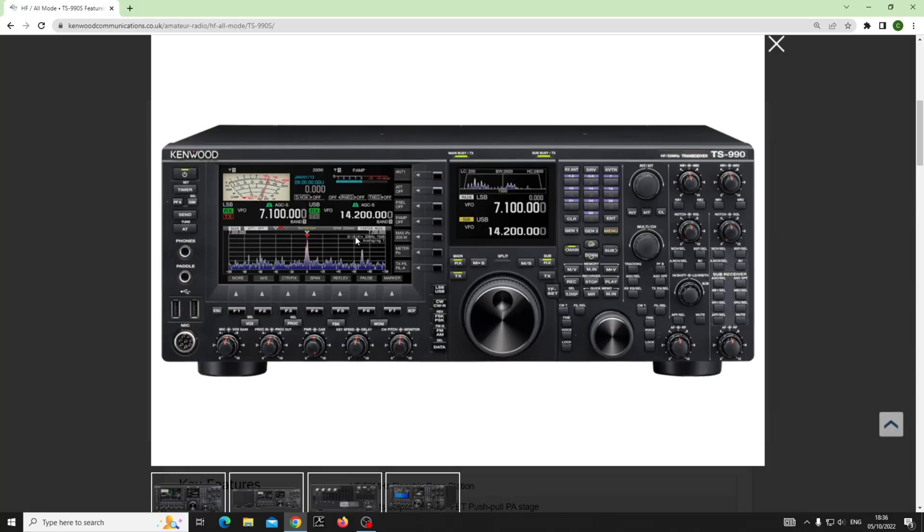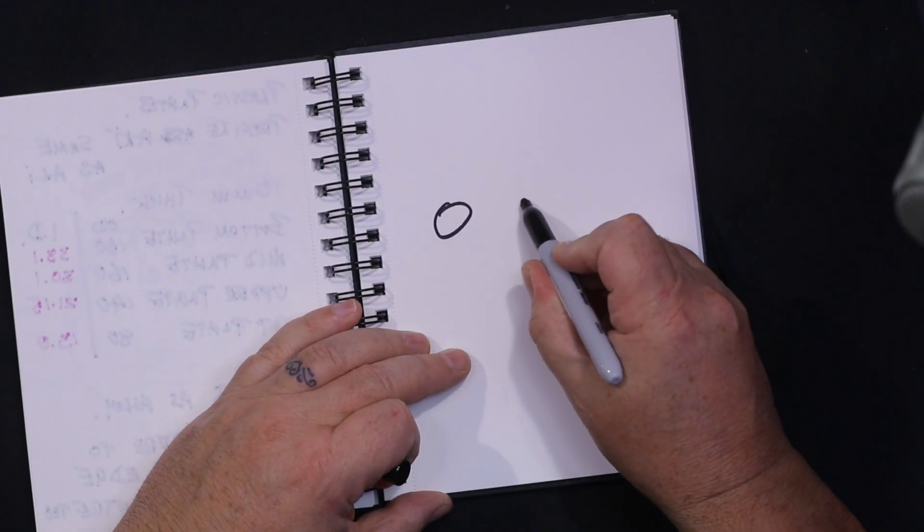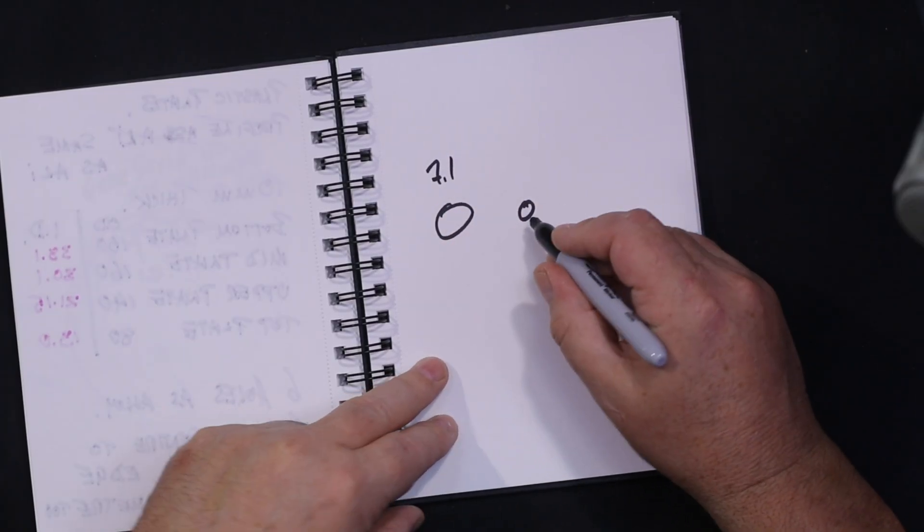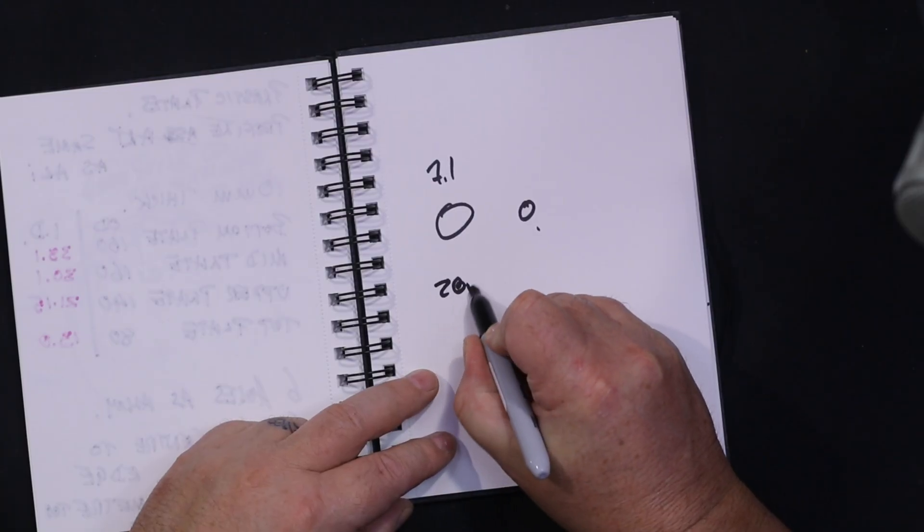There are others — Icom do one, and the FT-1000MP I think it's called also has two VFOs, because you can configure them. So what I do — it's kind of a big knob, little knob situation. The big one's my main VFO on the left-hand side of the screen showing 7.1 MHz, and then the other one can be on any other band you like. It also means you can have more than one antenna listening at any one time. In independent mode, I can be on the 20-meter band having a QSO and thinking, I wonder if 10 is open yet — I just hit the sub button, flick up to 10 meters, and on my right ear I can swizzle around on 10 meters.